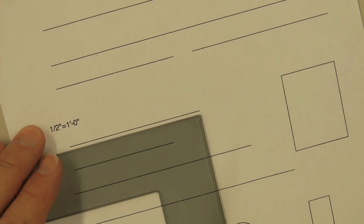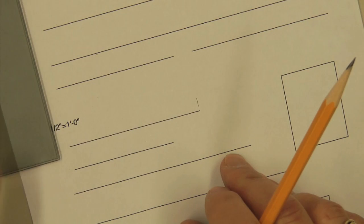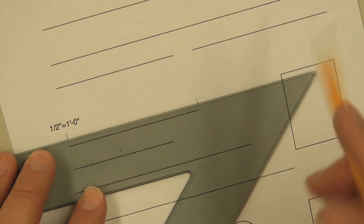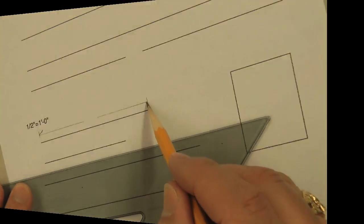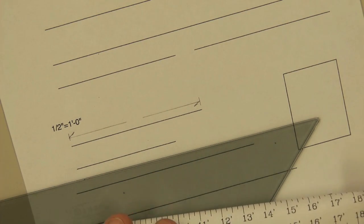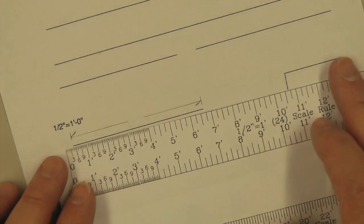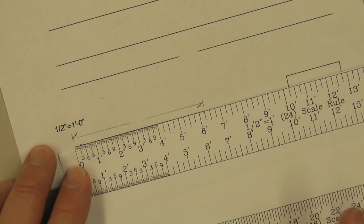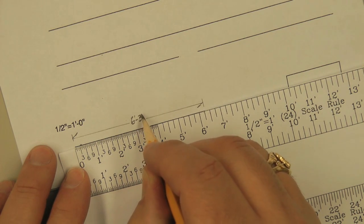When you're drawing your dimension lines and when you do this problem, you need to start concentrating on your dimension lines. I'm going to take my triangle and draw a little tick line there and a little line here, then draw a line from one end to the other with a little bit of an arrow. If I take my paper scale ruler and fold with a half-inch edge so I can get in there nice and tight — six feet there, I move over, and on the paper one it's six foot three. So I'm going to write down here: six feet dash three inches.